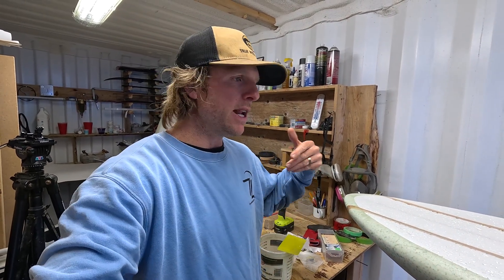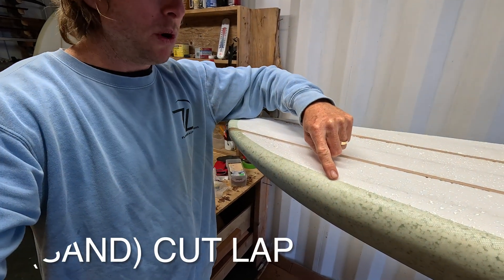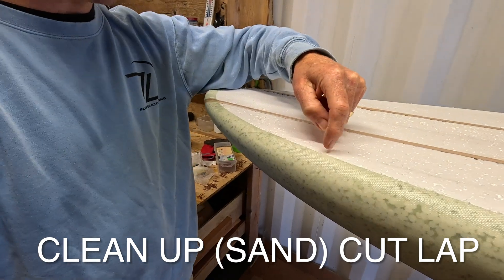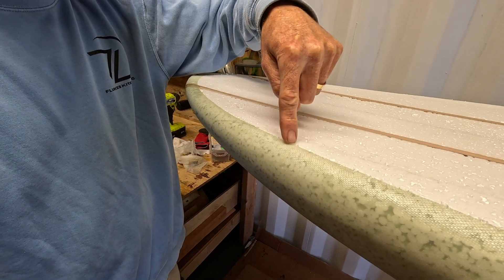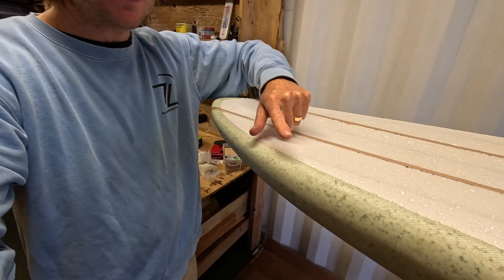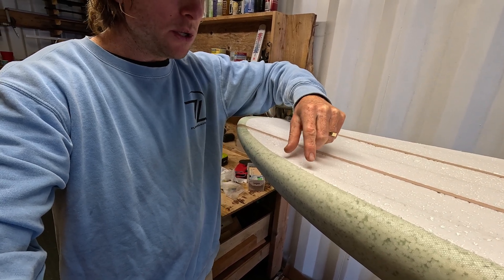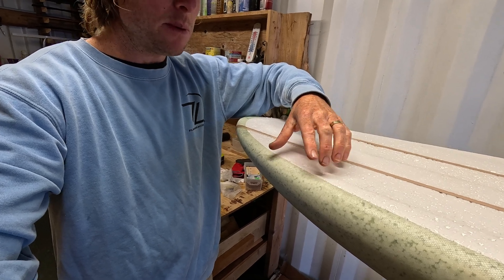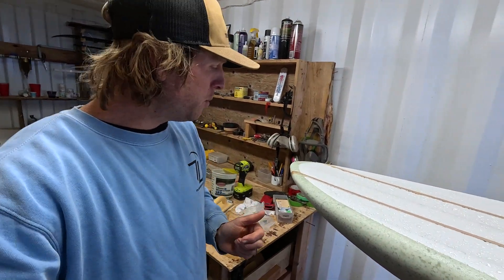In this video we're going to clean up the cut lap, making sure everything's smooth and sanded ready for fiberglass. We'll be cutting our patches, taping off the bottom, doing the same cut lap, running out our full length of fiberglass, and then pouring our resin and laminating. The first step is to clean up the cut lap — we don't want any sharp edges where we've cut along. It's spiky, so we want to clean all of this up to make it smooth, but we don't want to sand so far that we burn through the fiberglass.